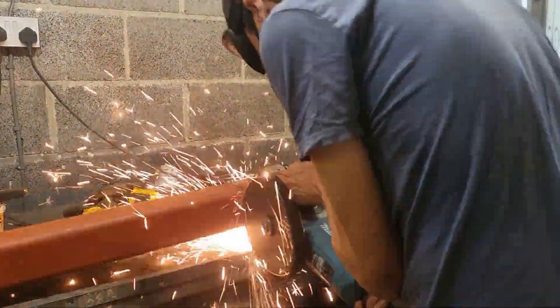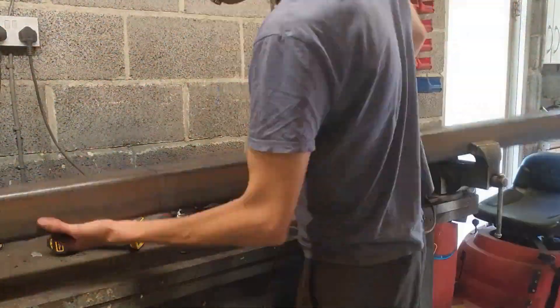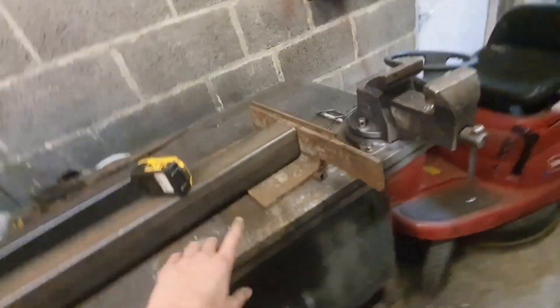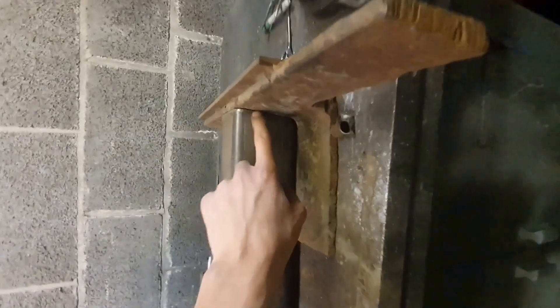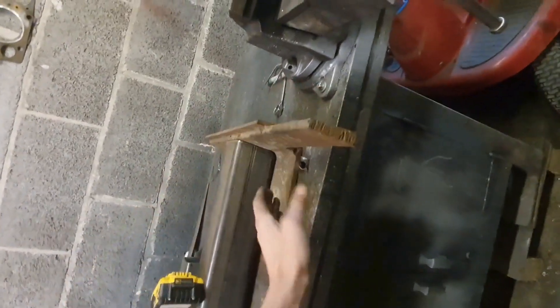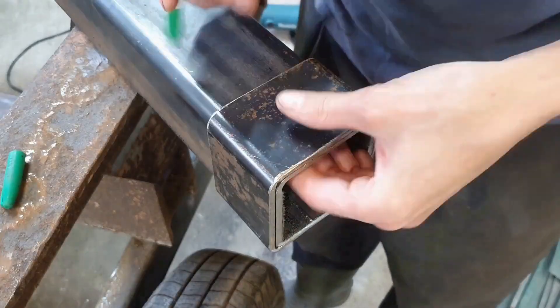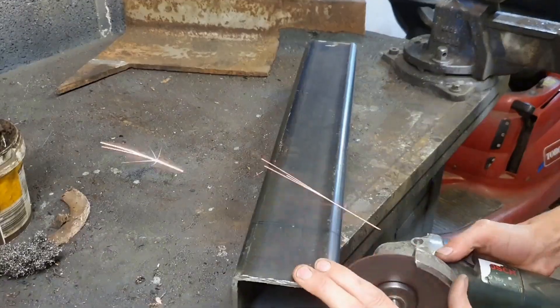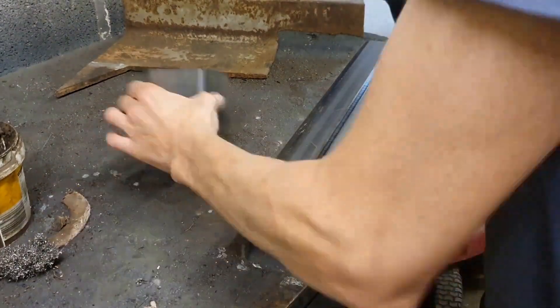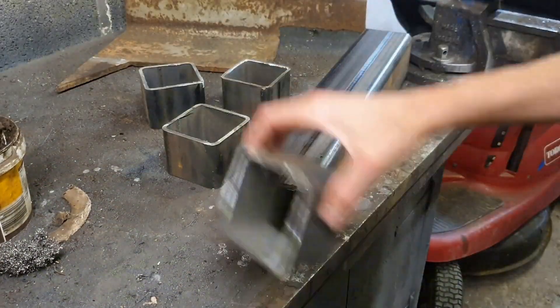This is how I'm going to solve the weight problem. These are 90 by 90 box with like three or four mil wall — they're very strong. I've put an angle on it now so that's going to fit up against the underside of this lip. I've also got some 100 by 100 here which fits over the top. So I'm cutting some 90 by 90s — I need four of those for what I've got planned. One, two, three, four.